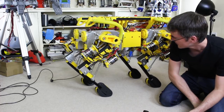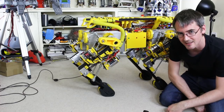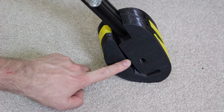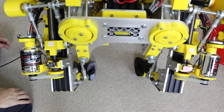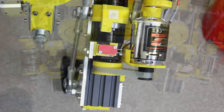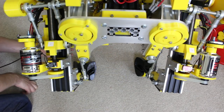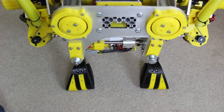Sometimes it's even consistent. There's a bit of a hiccup which I think was a buffer overflow. It seems to be turning on the spot quite a bit, but we're definitely getting there. You can see those foot pressure sensors squashing all the way down — they squash slightly less as I roll onto the front of them. I'm hoping you can see that this foot is quite a lot further forward than the other one — about an inch or more. I think that's because of belt slippage on the legs — those 3D printed pulleys on the smooth shaft have slipped again. I really do need to upgrade those to metal. I'm pretty happy with the motor speed though, so I'll probably just do a straight swap.